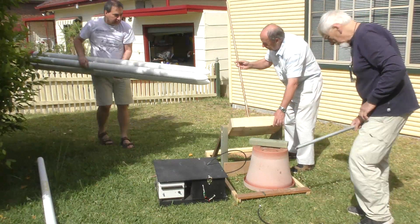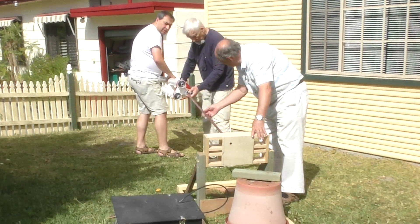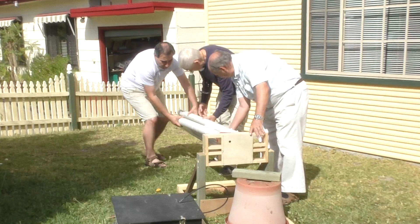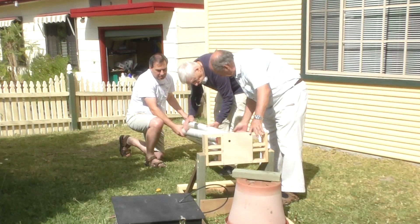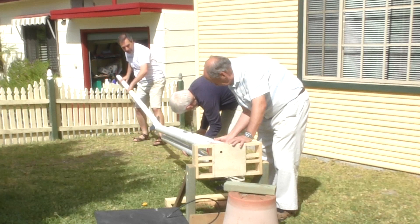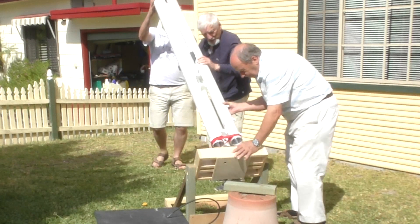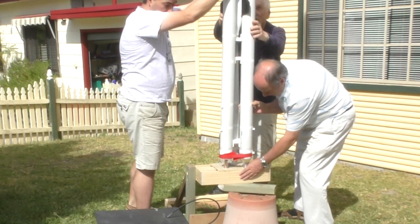Now it was time to try and fit the whole rocket on the launcher. We noticed that the booster got a bit of a twist in it when we did this, but that's because the spacers are only attached with tape and so it's a little flexible. In the final booster this will be a lot more rigid and twisting should be minimal. Although it was a little tricky to load — and will be just a little more once it's got water in it — it is doable, though it will take at least three people to get the rocket loaded and stood upright. We're using Charlie here as the sustainer for the mock-up. The rocket base was also high enough off the ground to make sure we won't spill the water from the rocket.